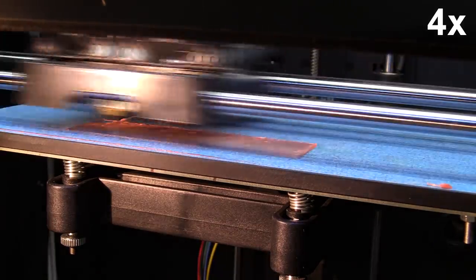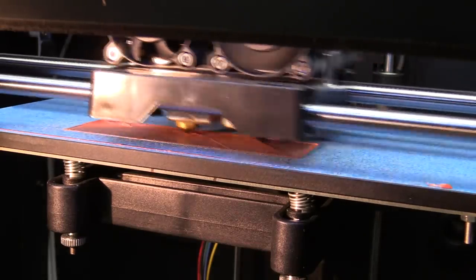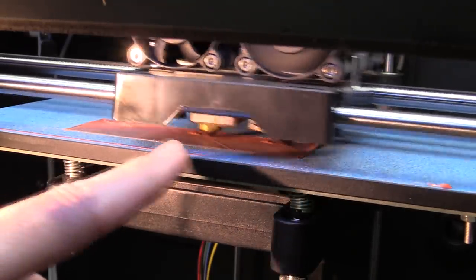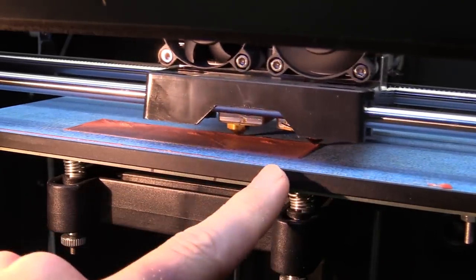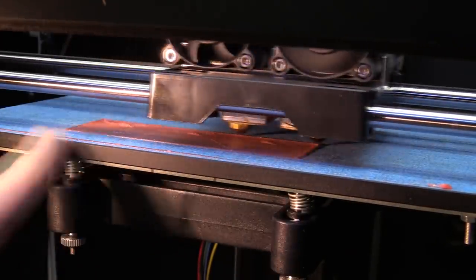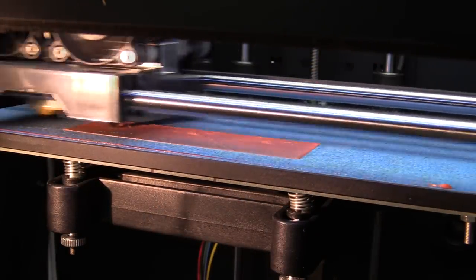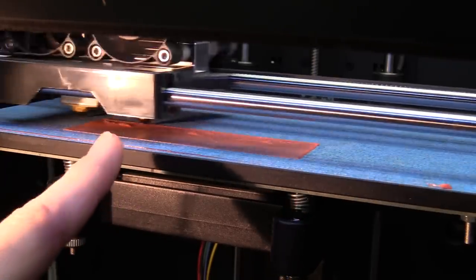This is a good example of why a single extruder printer actually can be better. The printer made a little booger over here, and when the next nozzle travels over that it will actually duplicate it, and again when the second nozzle travels over the second part. If you are printing across the entire bed you can actually make five or six of these across and they just get smaller and smaller as you go. If this had been a single extruder, it wouldn't have done that - it would only have made the first one.